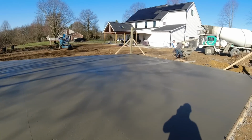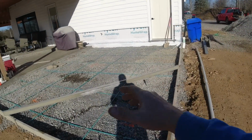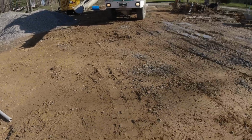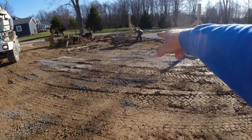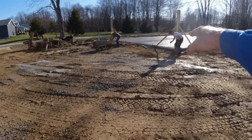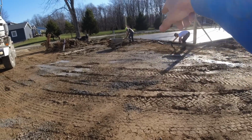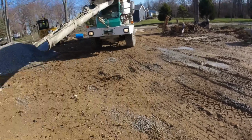Jumping around everywhere today. All right, heading over here. All of our chairs on the big four, so we'll spread, pick the rods up, and get going. Now they poured the bottom half. It's still pretty wet, so we're gonna take some 2-foot rebar, stick in there and do a tie in together. That's for a basketball hoop, so we want good tie in there, 3 feet down.